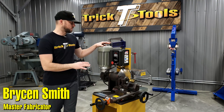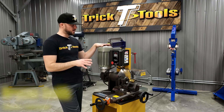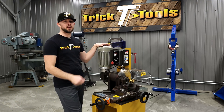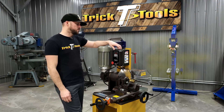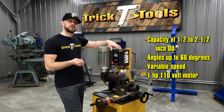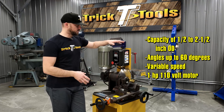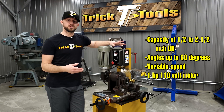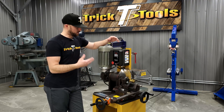There's a lot going on with this machine. For starters, it runs on 110 power, so no matter where you have it in your shop, as long as you have a 110 outlet, you can plug it right in and get to work. It runs on a variable speed controller so you can dial it in depending on material size, notch size, and get your speed proper for the material and the end mill that you have in there.